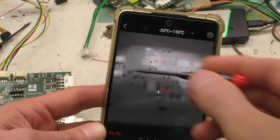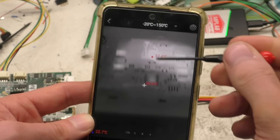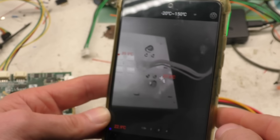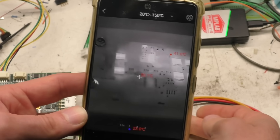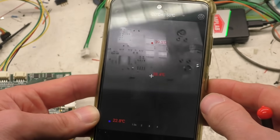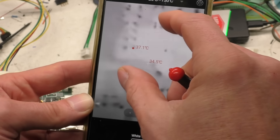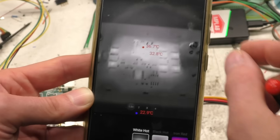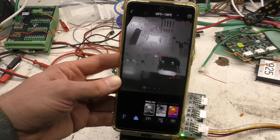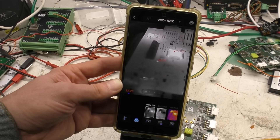In here we can see the six LED drivers — because they're not the hottest thing on the board, it's just showing the hot and coldest in this mode. Panning over to them, those are the hot spot at about 39 degrees. There's also a DC-DC converter here which is slightly warmer than the rest. Over at the player board you can see the main processor is only about 40 degrees, with another DC-DC converter up there.